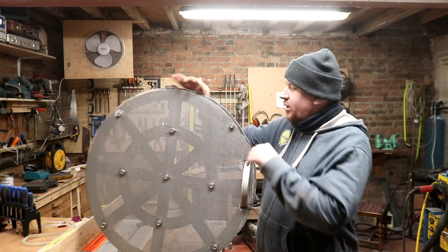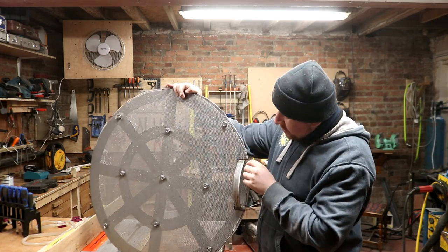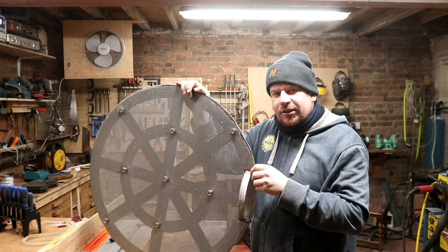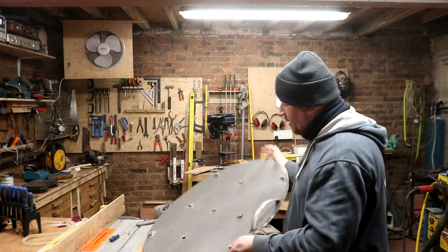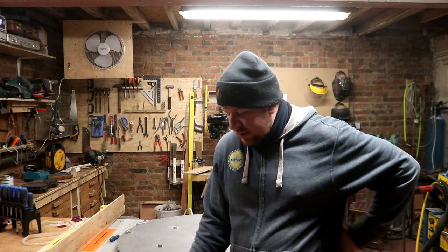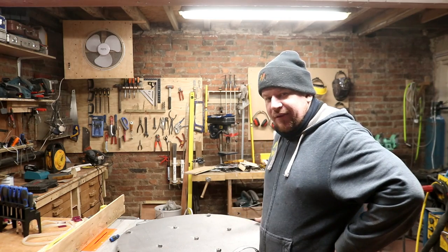So I think what's happening was grain is getting in around the edges, and basically, because we're pulling out of a half inch pipe into a brew pump 3000, the grain's getting into the pump, causing a bit of an issue. So I could either just let it go and have another go tomorrow and be a bit more careful with what's there, see how it runs, and then that'll give us a couple of options. Maybe I do an underback of some type, or we look at modifying this false bottom.